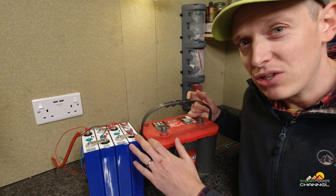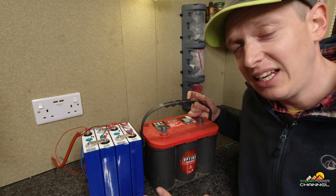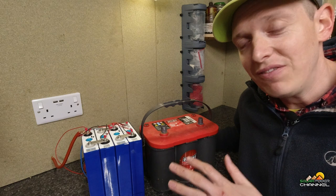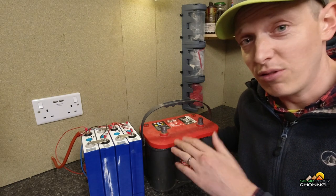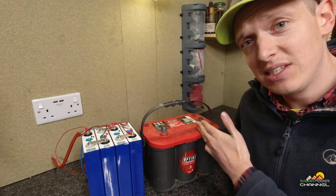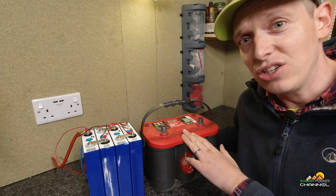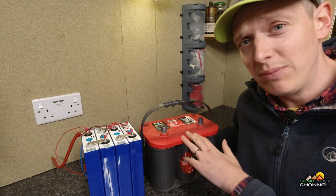Can you run a lithium battery not connected to a BMS? Yes, technically you can — you could almost run them like a lead acid. But it's strongly advised not to do that. The technology in lead acid is over almost a hundred years old, and this battery pack here is split up into six cells. So in theory, even a lead acid, if it was designed nowadays, should have a battery management system.